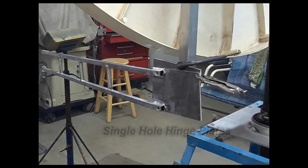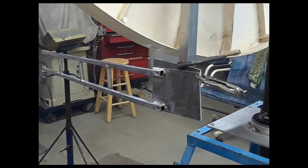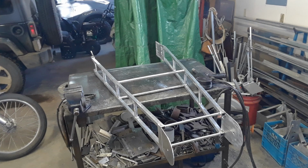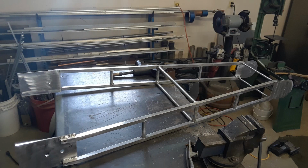I made these 2 square small aluminum plates out of 3/16 surplus I had laying around, and this is where the hinge point will be for adjusting the angle. I was kind of surprised that these small square tubes were long enough, so I had pretty well had the idea what I wanted to do. I welded in some of these aluminum tubings in between the 2 arms to hold them together.